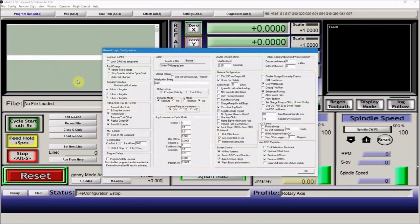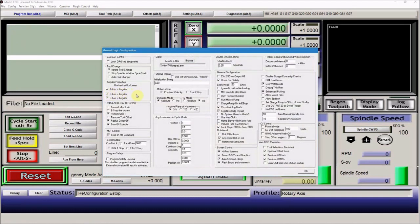Another thing to look at is in General Configuration. Normally when I'm running just the CNC router, the A-axis is linear, so I have that unchecked. But since I'm now using it with the rotary axis, I want that checked so Mach 3 knows the A-axis is in degrees. I also have 'Angle Short Rotation on G0' checked in the Rotational box. What that means is that if you have a G0 A0 command and that box is checked, it will take the shortest path to get back to A0. Sometimes that's a good thing, sometimes it's not — use it with caution.